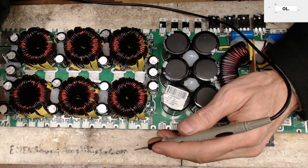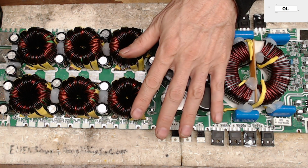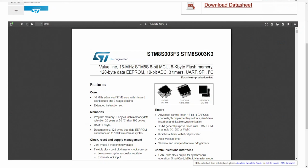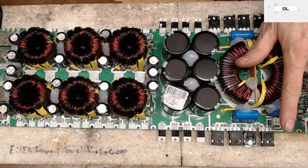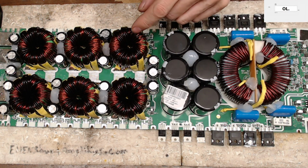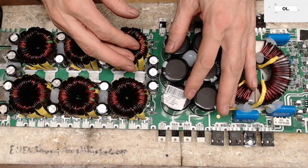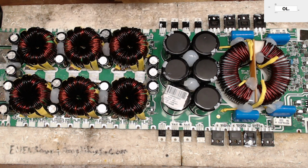So that goes back to another failed drive IC, which again, it's always hit or miss when you have failed gate drive ICs, because it is directly driven by this IC. If there's a fault in the power supply, it can work its way back to the MCU, which, obviously, you can probably buy the chip itself, but you don't have the firmware for it. It just becomes a real headache if you have a bad MCU. Get a hold of me. I may be able to get a new MCU for you. That's where we're at on that.